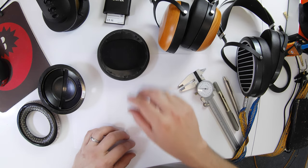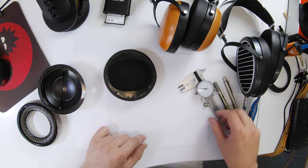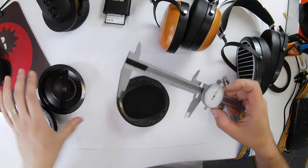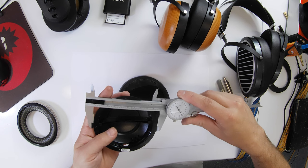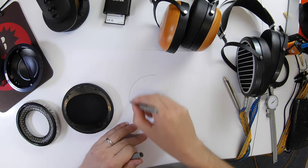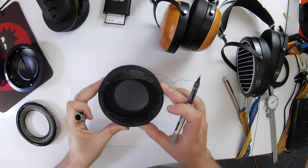This is a really good one to start off with because it's super easy — this is more reverse engineering than design. We essentially just want to copy this part here but make it compatible with Beyerdynamic-type pads. We're going to take some measurements. These are roughly the same size judging by eye: that is 102mm for the Beyerdynamic ear cup, and the pads fit over at 100–101mm, so roughly 101mm.